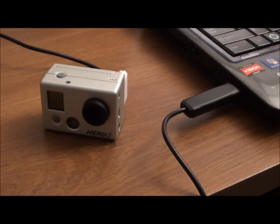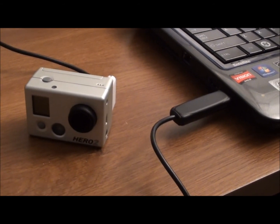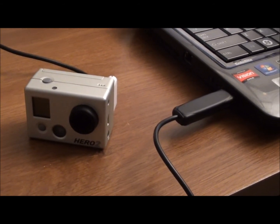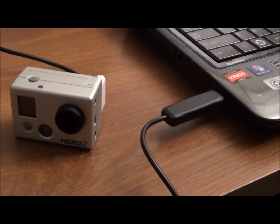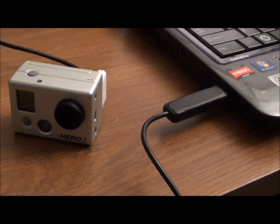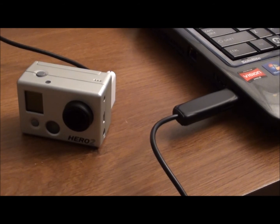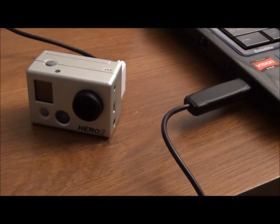In conclusion, we've demonstrated direct control of a GoPro Hero or Hero 2 camera via the PC using the Applied Logic adapter that provides the hardware connection. The adapter can also be used for custom software development — no DLLs or ActiveX objects are required. You simply need to open a serial port and issue relatively simple serial commands, and we'd be happy to work with you on your project. Thanks for your time.